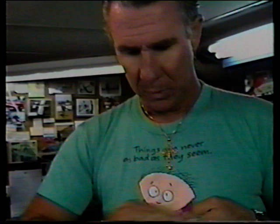I like to knock down each coat. Some people like to put on three coats and then knock it down. Once you start to see a little bit of a shine, a hint that you can reflect light, I don't know if you can see this, it'll just start to reflect light now. Then you know you're ready for one more thin coat on. In fact, before we put this coat on, we'll put just a few more drops of thinner in that mix of nitrate that we have, so that the last coat will have a little less of the brush strokes in it.